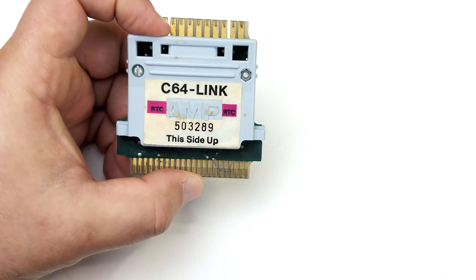The Link 2 has a peripheral interface adapter on one side and the EEPROM on the other. The interesting thing is that in the areas where those alligator clips would have been soldered in, this one has jumper wires installed instead. I don't know if somebody modified it to avoid the need for alligator clips or what the story is there. They're pretty simple devices — I don't think it would be very hard to replicate them.